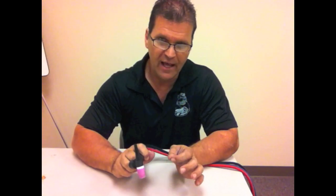Sometimes a balled electrode is fine and works great, but there are times you really need to pinpoint the arc — like when you're next to a bushing or a cooling fan you don't want to arc off on. With a big ball, the arc will wander around and next thing you know you've chewed off a corner you didn't want to touch. Having the ability to pinpoint the arc is a good thing — that's what AC balance does, giving you enough cleaning but not more than necessary.